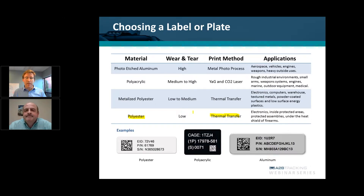In maintenance environments, the recreation of the UID is actually a fairly common practice, where you have to put something through a cleaning process that may destroy the barcode, in which case you need to reproduce the exact same UID — because that is the number that represents the birth record of that item. If that does have to take place, you want to be sure you know the exact data, the exact part number, and the exact serial number. It is a permanent UID to that asset; that number does not change.